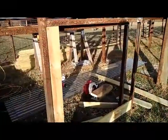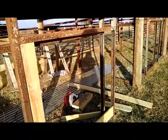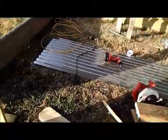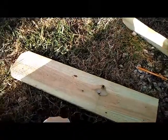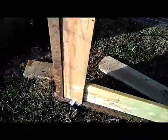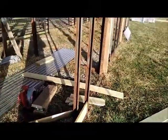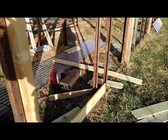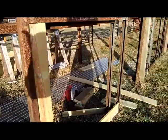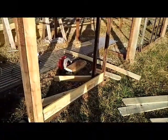We found these picket fence planks — one-by-sixes — and we're going to use them here. These spots were originally two-by-sixes, very heavy duty, but because they're rusted and warped they won't fit back in. What will fit is two one-by-sixes. I've got to trim this one just so it slides up into the hole where the two-by-sixes used to go. We're going to have one plank across the center with everything screwed to it — it'll act as a spacer and hold all the others in place. Then we'll evaluate if we need one on the bottom and top as well.